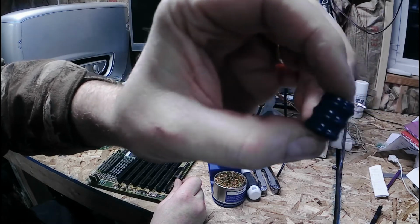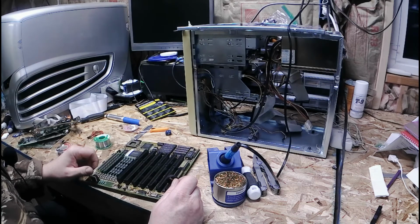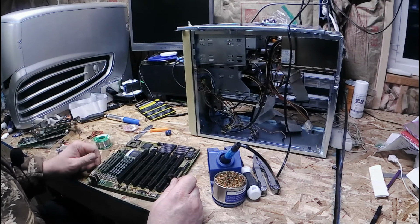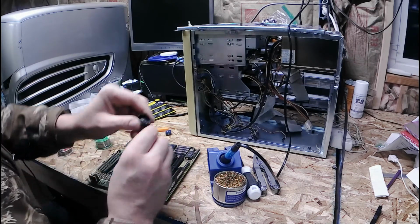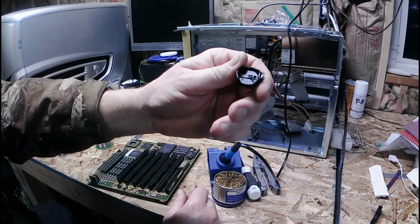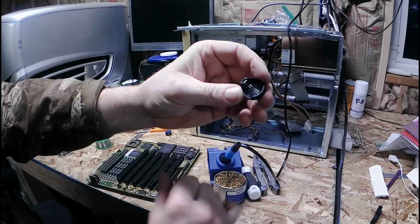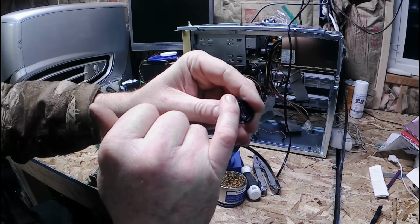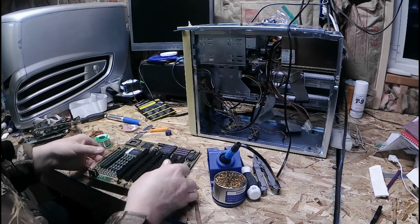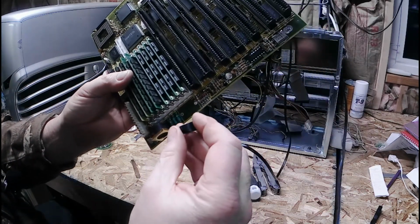Still very surprised it never started leaking on me. Just goes to show you, every now and then you find one diamond in the rough. So from here, we're putting in a socket style, or a button style battery holder. Your center is negative, your outside is positive. Line up here on the board. This one just happens to fit just right.